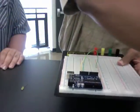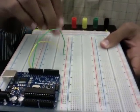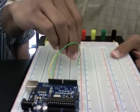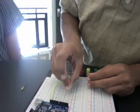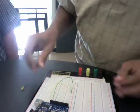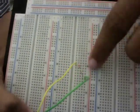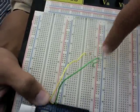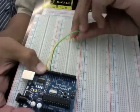Now what we're going to do is connect the resistor in that same row 25 with the positive. It doesn't matter which side — before or after the LED light — it still has to go through the resistor. So we're going to put it right next to the green wire. Then we're going to connect the other end of the resistor one row below the yellow wire so that we can include a connection between that and the LED light.